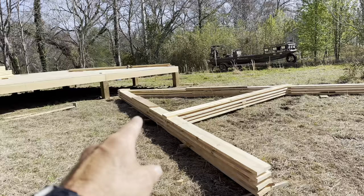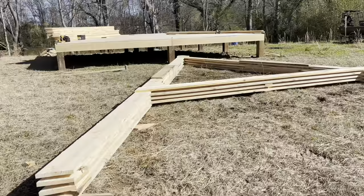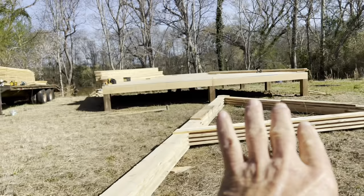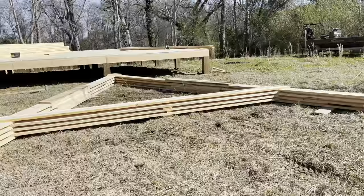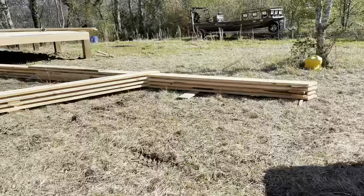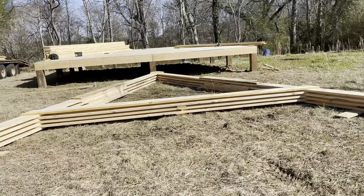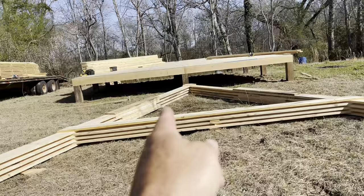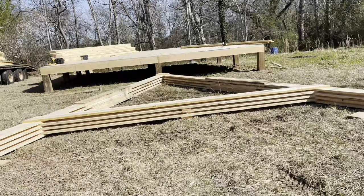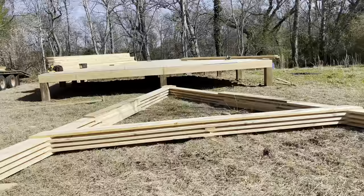Didn't have lumber long enough — it's probably a 26-foot span from there to there. Got a big scab there in the middle to hold those two together. 24 foot wide, 24 feet tall. Let me tell you, that is a handful by yourself dragging them. What I'm doing is building them up there — I've got a little jig set out and some lines popped, and I just lay everything out up on the deck right there, screw everything together, and then drag them off out here so they're not blocking me. I'm gonna have to have a cherry picker or something to come help me. Those 16-footers in the room are going to be the ceiling joists for downstairs and the floor joists for upstairs. I think it's about a 10-foot wide room before you run into 6 foot on both sides, so you're gonna have maybe a 10, 12-foot room up top before you start rubbing shoulders on the bottom side of the rafters. A pretty good bit of room up there — enough for two bedrooms and a bath.